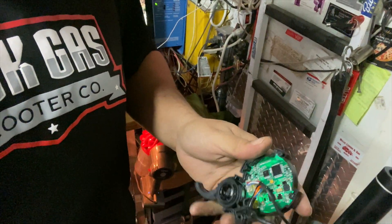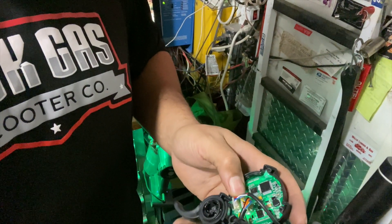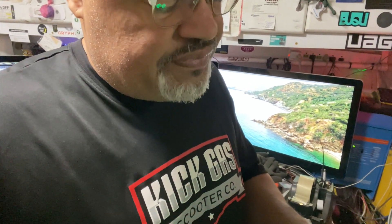I can't totally silicone it, but I wonder if it would help once it dries. It looks like there's a slight coating on it already. I left this out one time and it got a little wet and fogged up in here. I just sprayed it real deep with alcohol — if you ever get anything like that wet, any electronic, spray it with rubbing alcohol, real deep, and don't try to turn it on. Just let it evaporate, give it a couple days, and it'll dry out whatever the water has damaged.